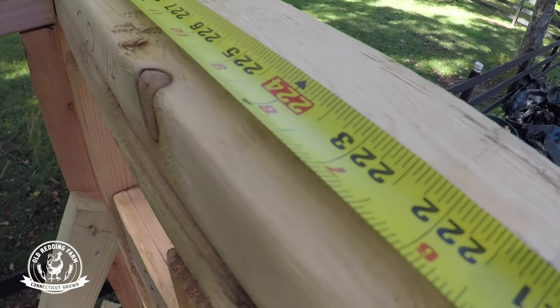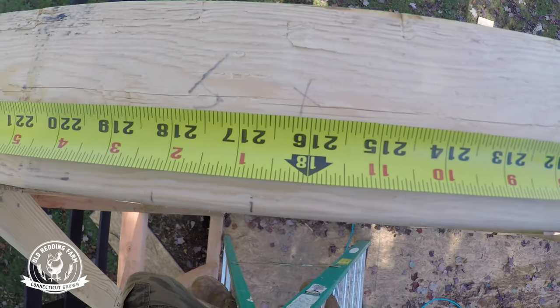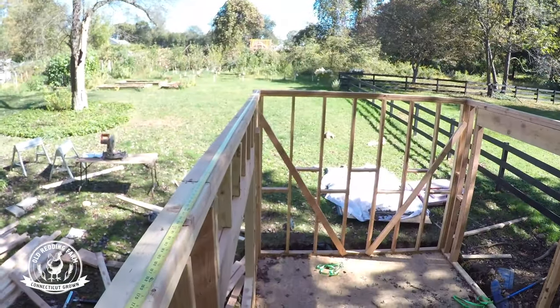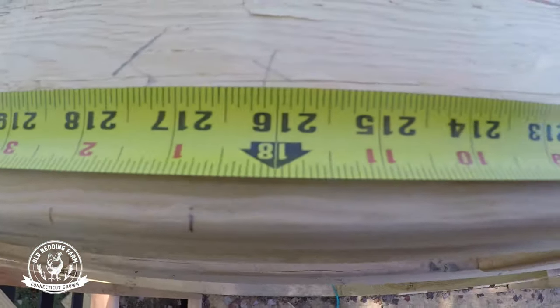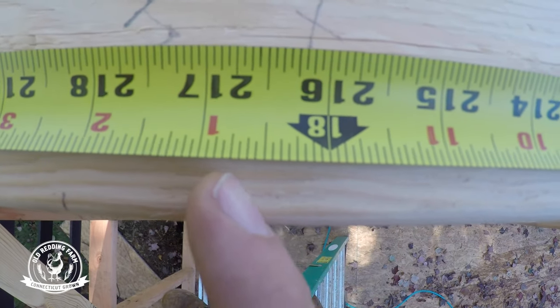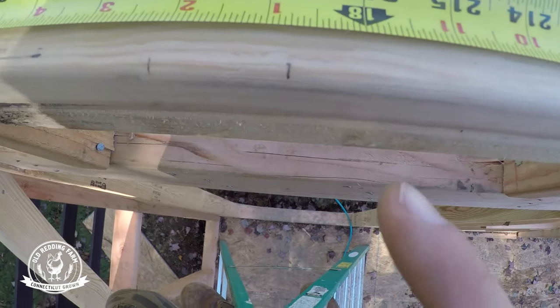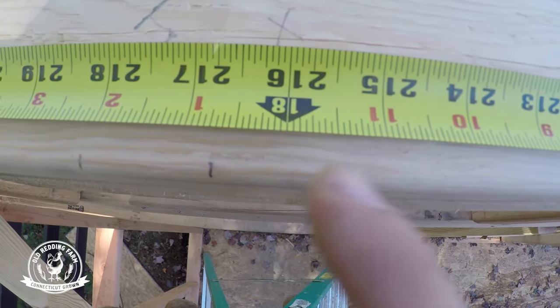So what I'm doing is marking my rafters. So these are 24 inches on center, and I made sure that I started the tape at the same end for both sides. So you can see, I didn't go real fancy with this. Because when you do an on center anything, it's actually 3/4 of an inch either way to make up for the 2x material that's going to sit there. So instead of marking both edges and doing a line, you just mark one edge and it's going to go the opposite direction.